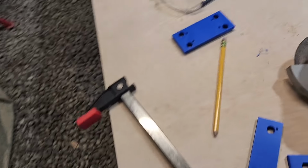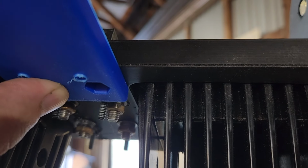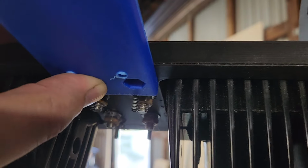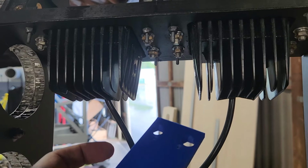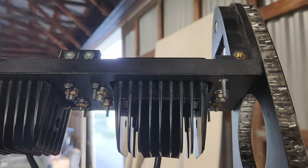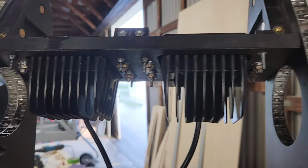The other job that I did, so this is just cheap PLA plastic. So this will mount on here, and you can see there's enough of the bolt showing through that I can bolt those on. That's a happy coincidence that the bolts that I had were actually way too long, but it proved providential because they're just the right length now. So I just need to make the changes on this one, print it out again in this cheap stuff, make sure that everything fits, and then print it out in polycarbonate and do it for real. Not a huge job, it's just something I can sit down and do at home.